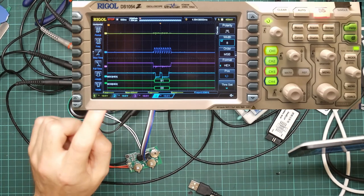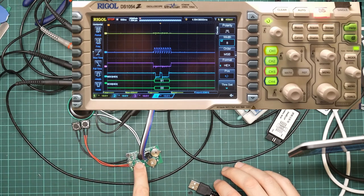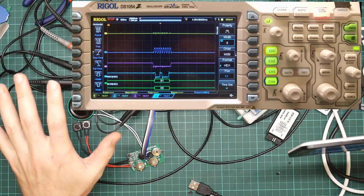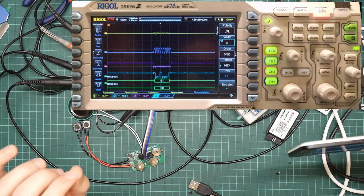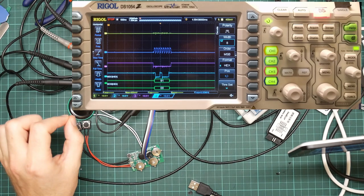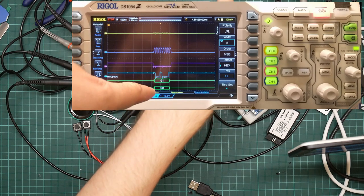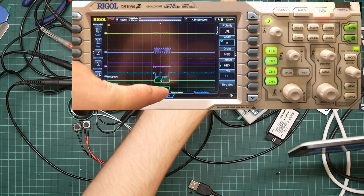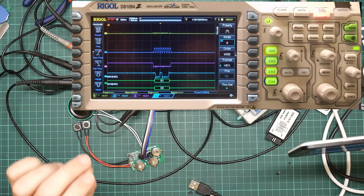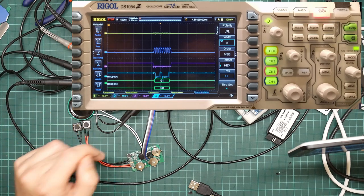Right. So almost certainly what the processor, that is this blob here, is doing when it's talking to the flash chip is it sets up various communications. It looks to see if there's anything on the flash chip. Then it sets up a byte read transaction, which basically will just return bytes until further notice. And then whenever it wants a byte, all it does is toggle the clock 8 times, and it gets back a byte. In this case, it's hex 91. And then there's a long pause before it requests the next byte. This is because the bytes it reads are going to be fed into the audio decoder, and the audio decoder is going to consume bytes quite slowly compared to the microcontroller. Good.